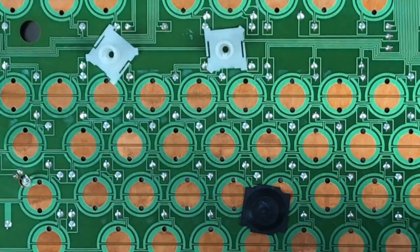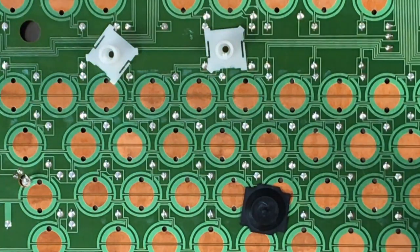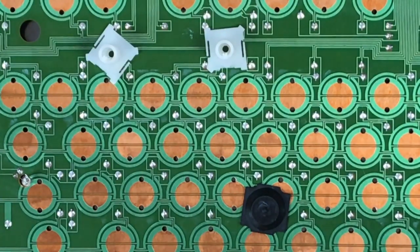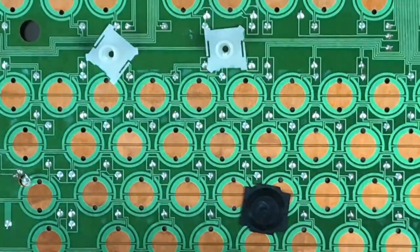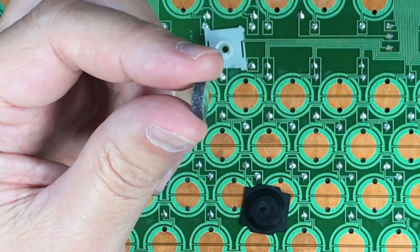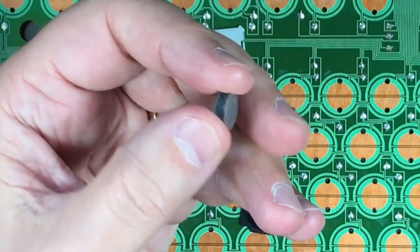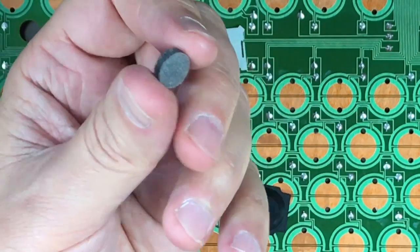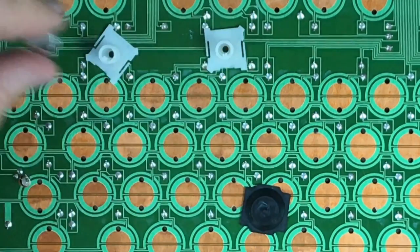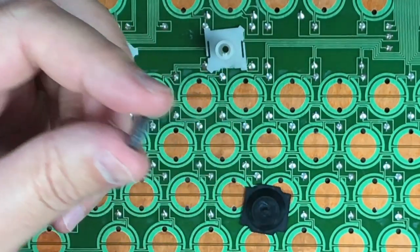Well, I also didn't count my foam and foils to see if I have enough to cover this keyboard or if I have any spares and I can play with destroying one or two. If I tore the foam out, I need a tiny dab of glue to stick the Mylar without leaking out to this part. And then this part has a peel off glue to go to the underside of the dome.